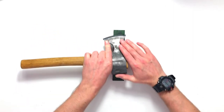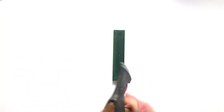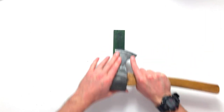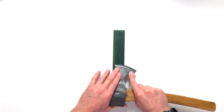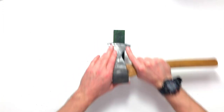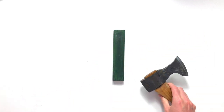I'm not going to go too crazy with the strop here. This is exactly how I maintain my axe for long periods of time — simply just stropping, nothing else. And that's all it takes as long as you bring the edge up to a fine edge at 5000 or 7000; it maintains on a strop very, very well. It's important that we keep the axe sharp — if we don't have a sharp axe we're going to have glancing blows and it'll be much more difficult for the edge to cut into the wood; ultimately it's going to be more dangerous and less pleasant.